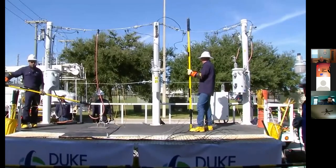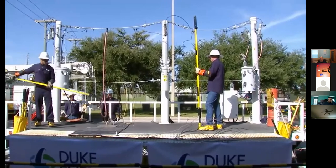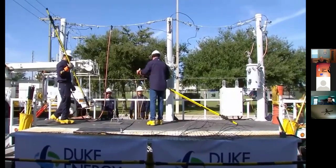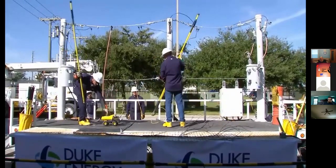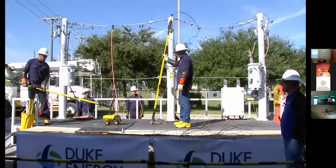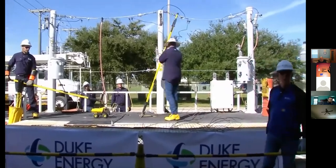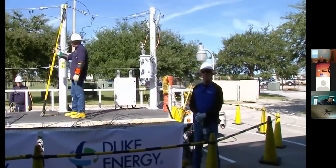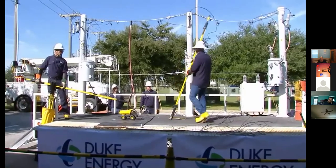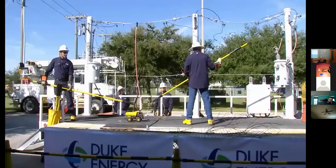If you've got a line laying on the ground, please don't touch it — let us come take care of it, because there are scenarios where that line might not be dead. Here's what happens when somebody decides to grab it and kick it out of the way — all you've got to do is disturb it. Another thing that kills a lot of our lights is a car versus a pole. As a first responder, you've got a car sitting there with a lady and a kid in a car seat, and a power line laying on top of the car. You'd think the line's down so it ought to be dead — here's what it looks like when it's hot. That truck is energized at 7300 volts waiting on you to go open the door to get her out — pretty bad business.